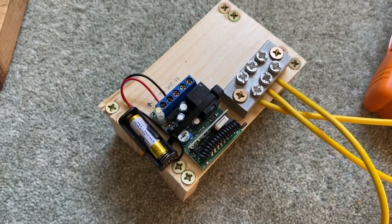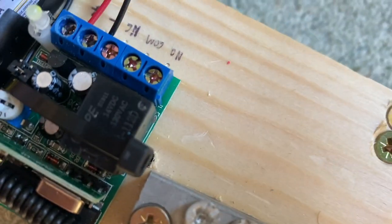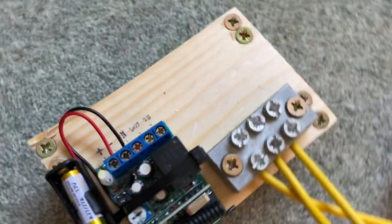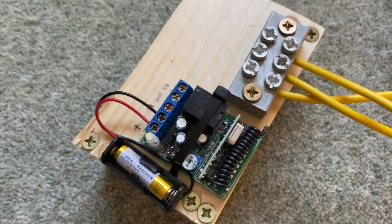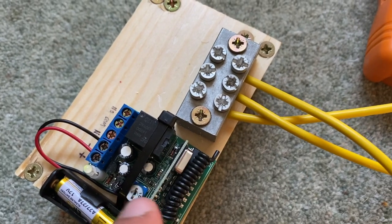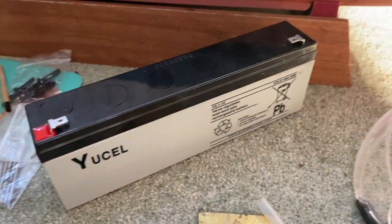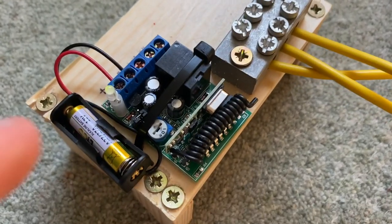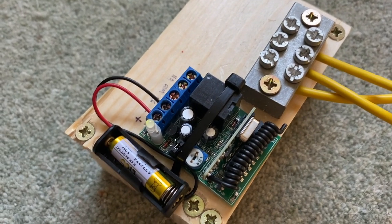So here I'm just doing a little bit more fiddling around with electronics, and this is my relay, which, as I was saying in the last episode, is able to cut the main power to the boat. And what I've done is I've attached it to an external 12-volt battery. The reason for this is that I'm a bit worried, you know, there's sensitive electronics in here. If I connected it to the main batteries of the actual boat, there's a danger that any ripple caused by the motors turning off may damage this electronics. So I've fitted it in with an independent battery system.